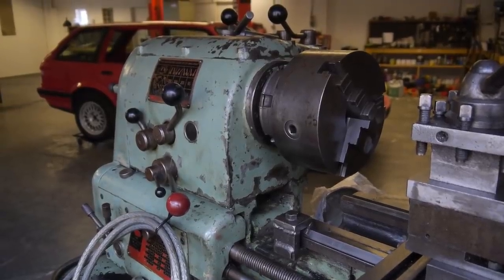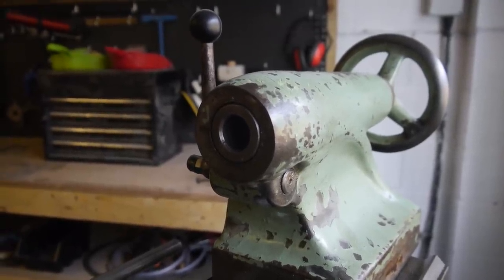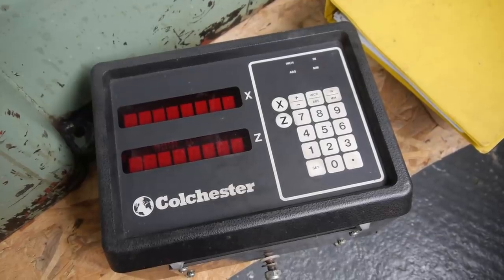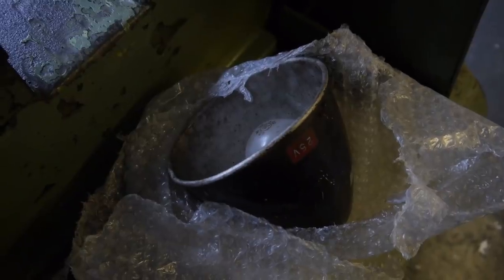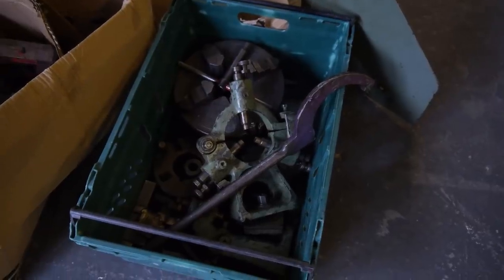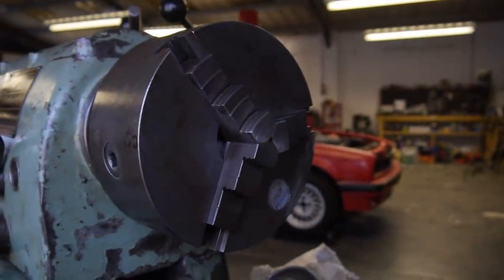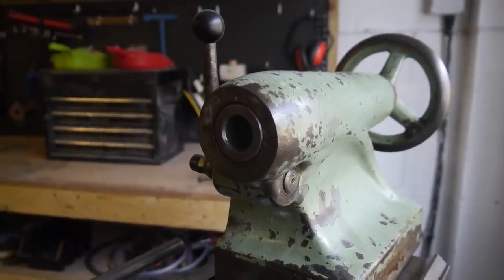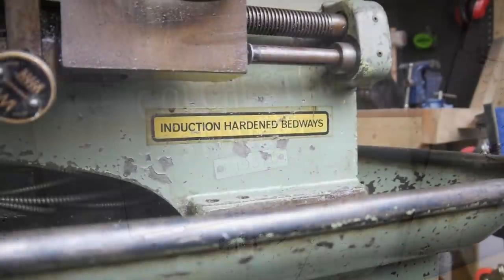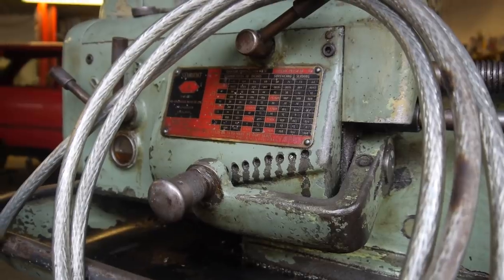It's currently fitted with a 3-jaw automatic chuck, a Colchester taper attachment, and I think a Morse taper 5 headstock — there seems to be some confusion about the definite size so I'm going to measure it myself. It was slightly dismantled before it was shipped to me. This Colchester DRO was fitted and functioning so that needs to be installed, as well as the original lamp. It also came with some extras: a 4-jaw automatic chuck, 2 fixed steadies, the C-spanner, some reverse jaws, some tooling, and some metal blocks to help level it. I was told by both the previous owner and Rob that the centre points between the headstock and the tailstock were aligned within a quarter of a thou, which just goes to show the level of build quality Colchester were producing 70 plus years ago. I'm going to leave a link in the description to a video of these lathes getting made in the Colchester factory — it blew my mind how these machines were produced and I'm super grateful to now own one.